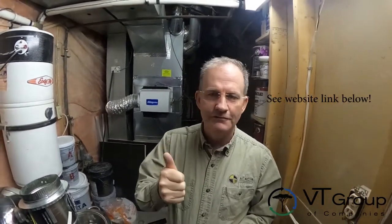So one more time, just to recap — this is your fresh air intake. It's a Hoyme — H-O-Y-M-E — damper, manufactured right here in Canada. They don't sell them directly from the factory as far as I know, but feel free to go to their website and talk to your heating contractor. It's going to help you with draft proofing and air sealing, make your house more comfortable, and I strongly recommend running your furnace fan on a more regular basis. In one of our other videos we'll talk about furnaces and furnace selection, and by having that ECM motor that's part of furnace selection. So if you're ready to upgrade your furnace, you might not just need the damper — do this at the same time.